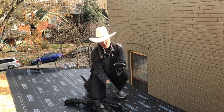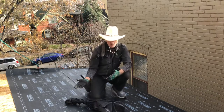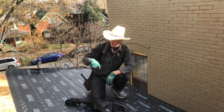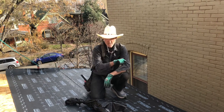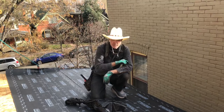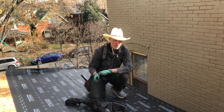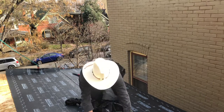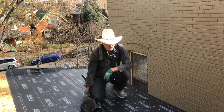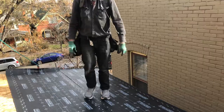This base sheet is a really nice waterproof base sheet, and it's smooth on top because the cap sheet is going to do the same thing — it's going to stick to the top of the base sheet and doesn't require fasteners. We still have to put the metals on next, so the next video I shoot will be putting the edge metals on and seating those down in a mastic or tar. That's how you put this product down — the base sheet — and next we'll do the metals going on the edges.